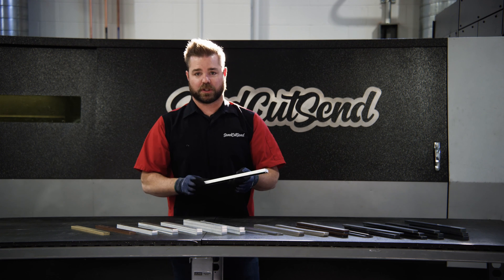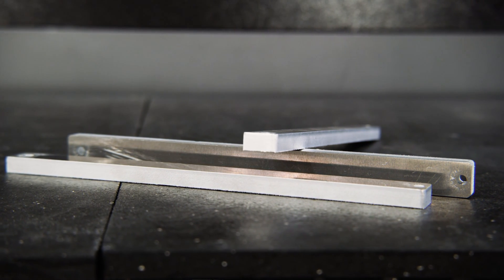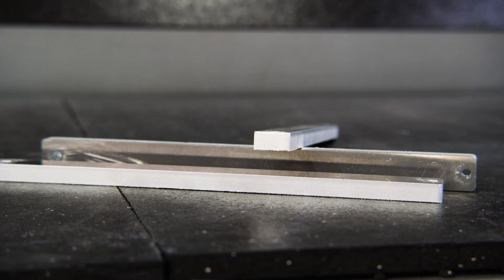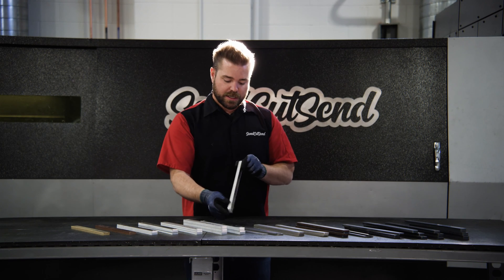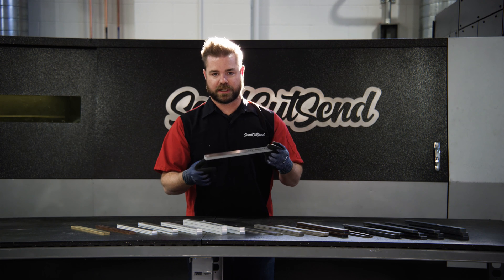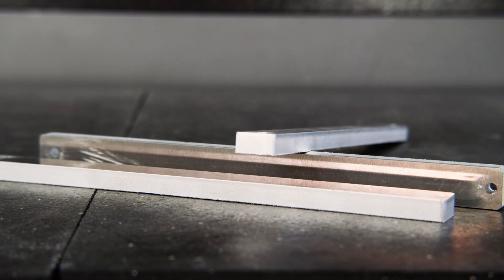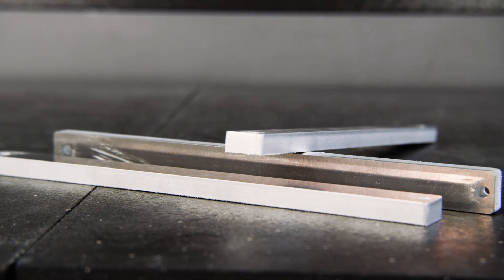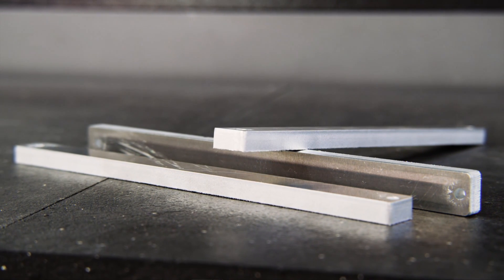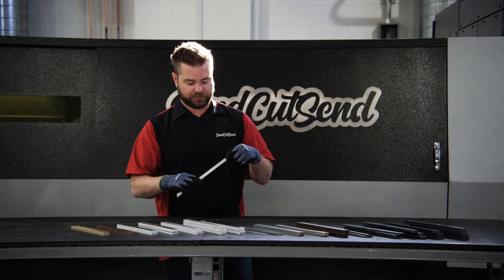Next we have some really thick aluminum — this is half inch thick 5052 series aluminum. This is a little bit more aggressive of an edge than hot rolled or stainless — probably closer to a 180 grit finish on the side. It's still comparable to waterjet; I don't think you could do this with most plasmas available to a hobbyist. The only thing with aluminum is we will have a little bit of dross, a little bit of sawtooth edge — probably 10 thou on the bottom — but the good news is it just knocks off with a file or a DA. You can also use our deburring service and we'll take good care of you.